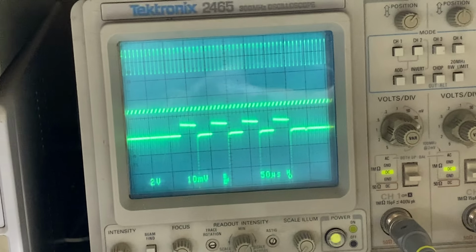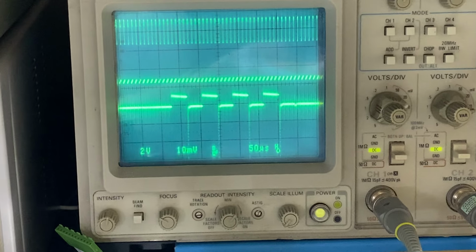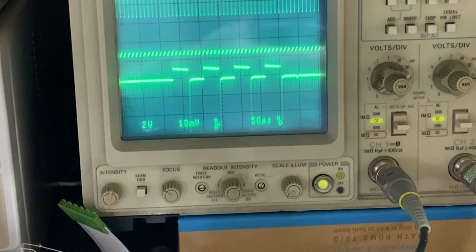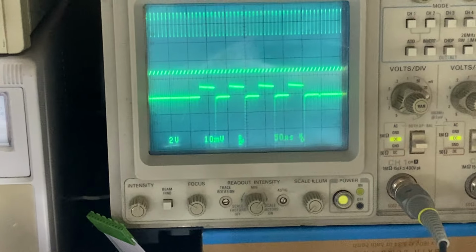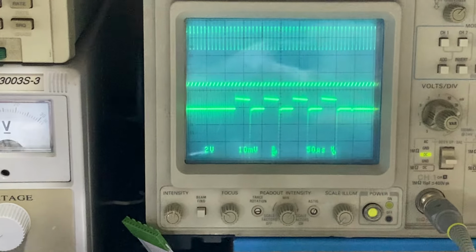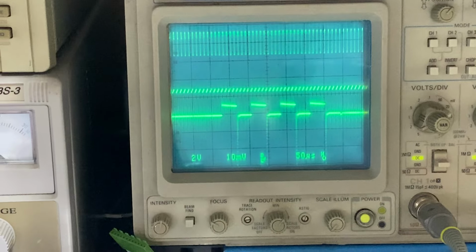If you make these things more sensitive and make it go faster and things like that, the power supply noise gets worse. So I had a look at putting some of these little boards in, and they are not fast enough on the turn on. They're very laggy. I've got some sitting down there, a thing with a coil on it. They said they were fairly fast turn on. They're not. They turn on halfway through the event of the receivers. It's not a good thing.